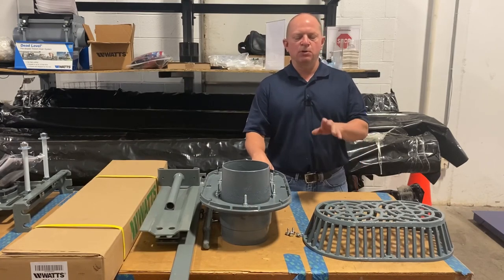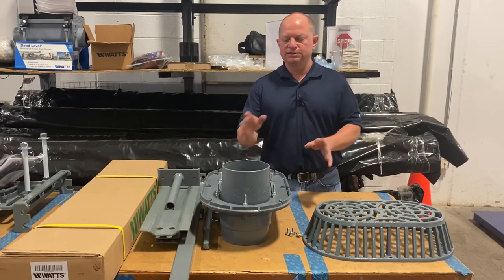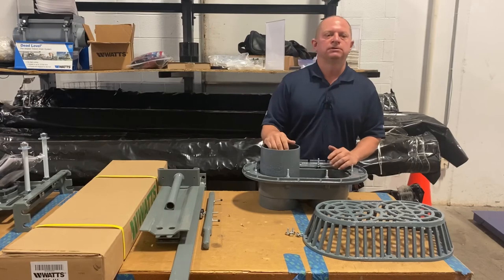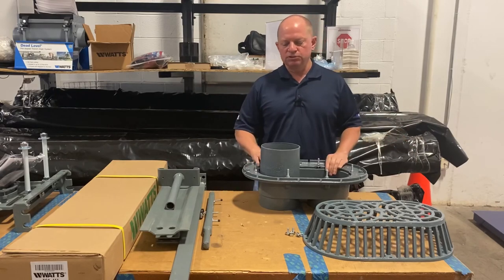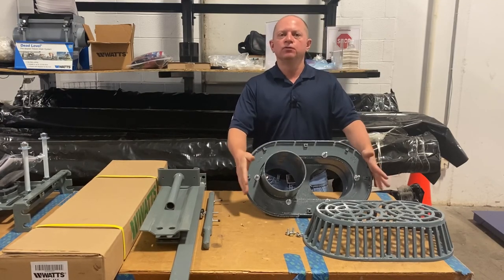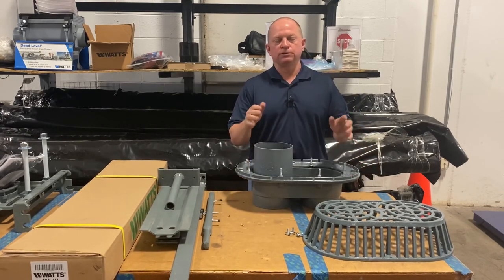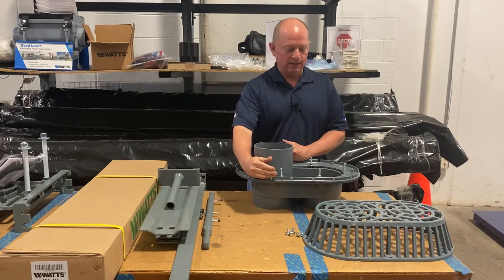I know you didn't ask to see this, but I wanted to show it — once we get this in front of an architect or engineer it sells itself. This is the Watts combination roof drain and overflow drain, all one piece. Most people will get a big pan and put them side by side, but what's nice about this is the compactness. It basically takes up the same space as a regular roof drain — the Z100, Smith 1010, or Watts RD300. You're only doing one penetration, which building owners prefer, instead of two.